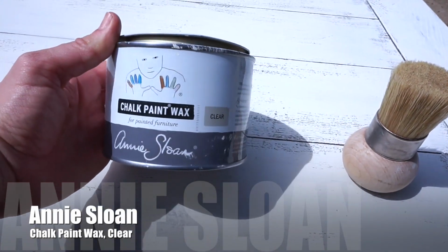And chalk paint doesn't take long to dry. It takes maybe 30 minutes to an hour. So you can do that in one day. And then what you go in with the third step is the clear paint wax. I like the Sloan. This just seals it, and I like the clear because I don't want any color added to it. You're going to put this on fully, and you're going to do it in a circular buffing motion.